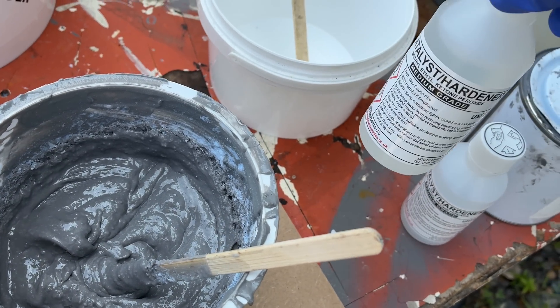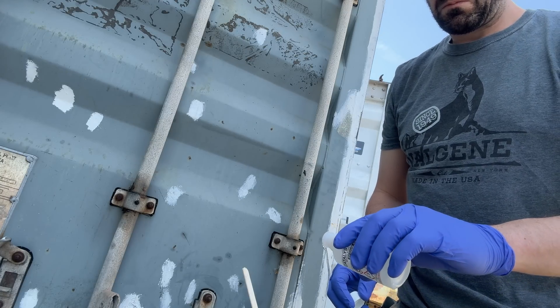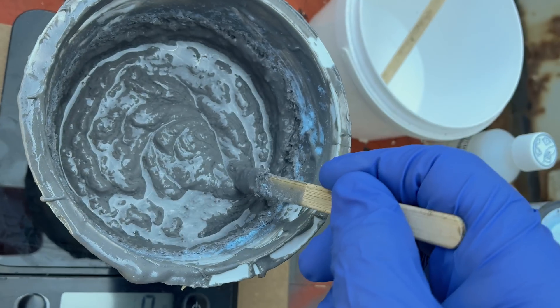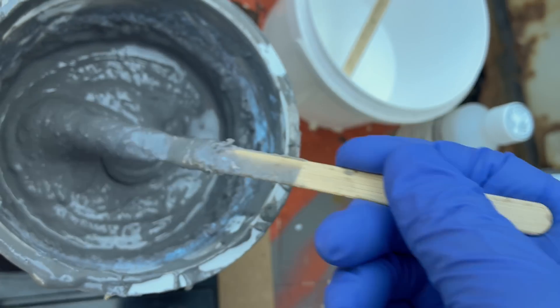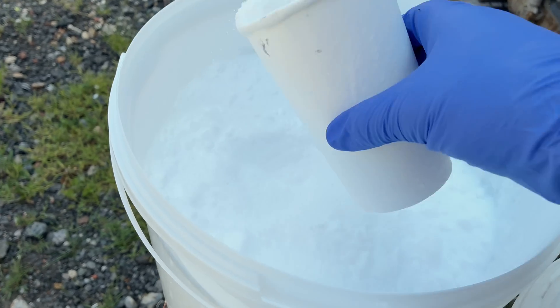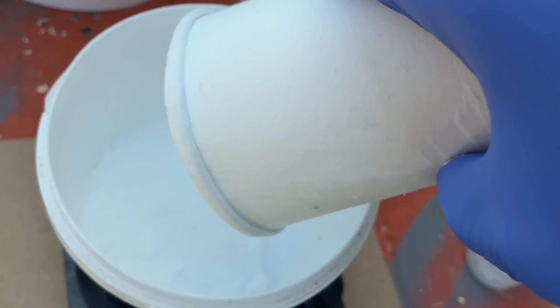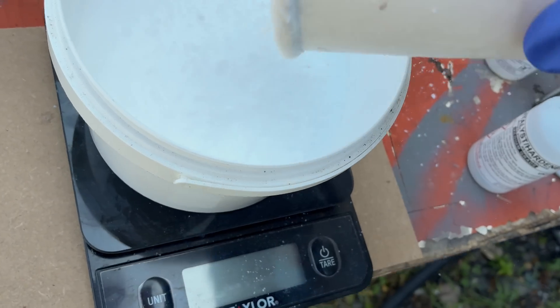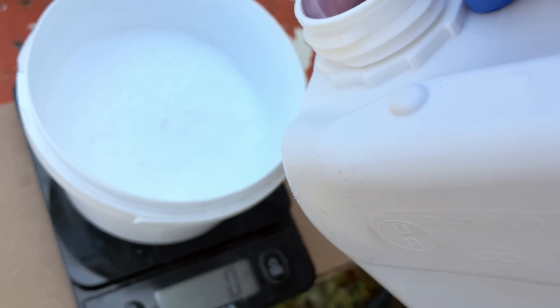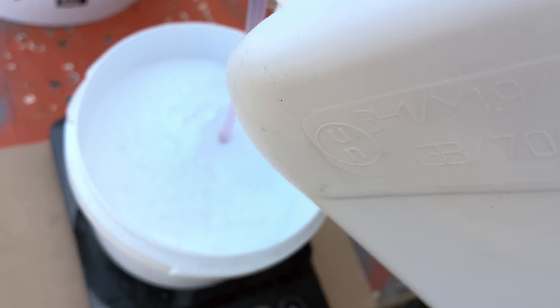Now the catalyst's been added. It's a hot day and the pot volume is large, so to avoid the resin kicking into an exothermic explosion before I can use it, I'm using only 1% of summer grade MEKP catalyst. This is not much cheaper than buying ready-made filler by the 5-litre tub — I just don't like wasting resin, and this old batch can't be used for layups. I also get to alter the consistency for each batch. I experimented with putting the powders into the mixing pot first and then adding the resin to smother the fluffy silica that wants to float away, but the resin just passes straight through it.